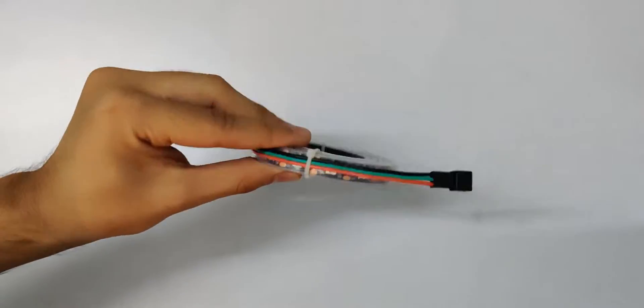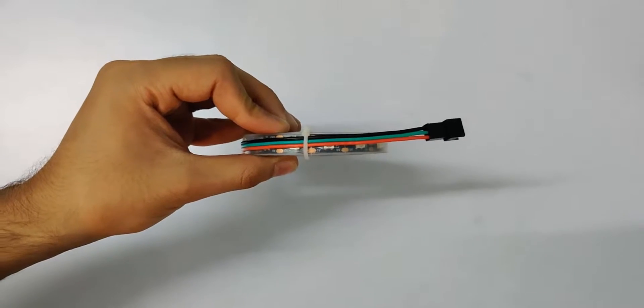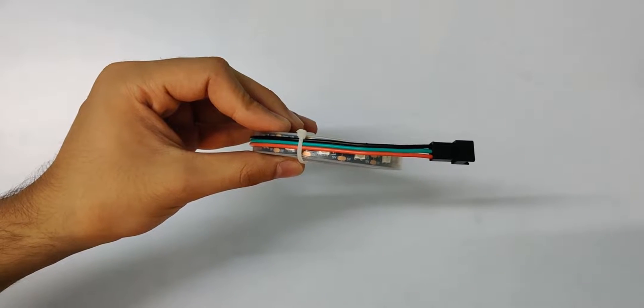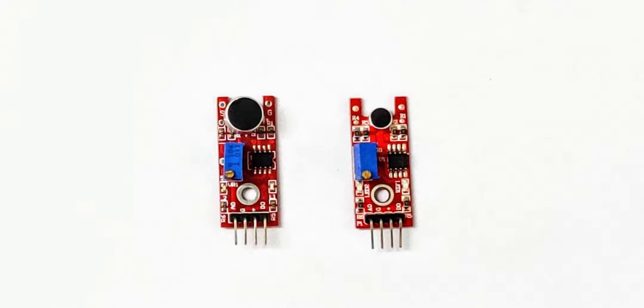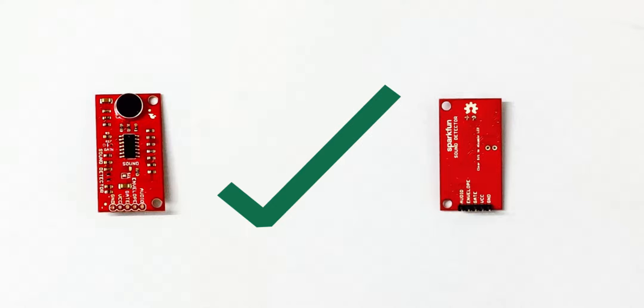For this project you'll need an addressable LED strip. An addressable LED strip has got 3 wires — 2 for the power input and a green wire for signal. The green wire gets attached to a digital pin of the Arduino board. Next you need a SparkFun sound detector module. Most of the times we get a sound sensor module, and that's a different thing — it doesn't provide a wide range of analog output. The sound detector has got 5 pins, out of which we'll use only 3: 2 pins for power input and 1 pin is the envelope pin, which gets attached to the analog input pin of the Arduino board.